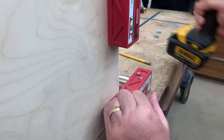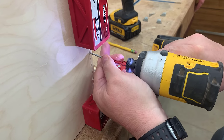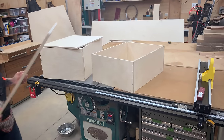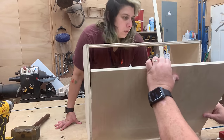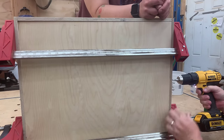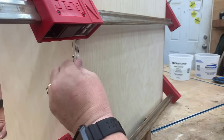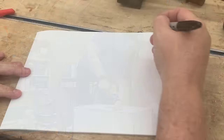The screws go in on that center line, putting the holes dead center through the plywood thickness on the other side. These are finishing screws — stainless steel throughout. I know wood isn't ideal for a hospital setting, but I'm not envisioning this as a long-term container, just something to get them through a rough patch. Everything has been coated with about six coats of polyurethane, essentially giving the box a thick plastic layer. We pre-drill holes, put screws every three to four inches around the perimeter, remove the clamps, and screw in the remaining areas.